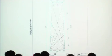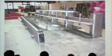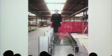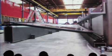And we finally got the client to make a sample, this is at 3 meters long, about 800, 900 wide. And we put it in a machine to bend it. And so that's the panel, and this is the corner that we need to go down. And it took, funnily enough, almost exactly the weight of one engineer on the end to bring it down 150 millimeters. And it did actually go down 150 millimeters, and that is it. You can see the edge is nearly straight.